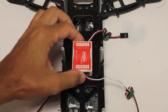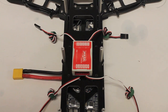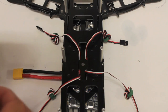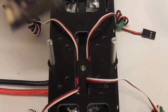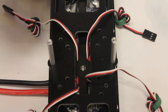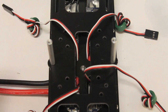In this video I'm not going to be mounting the flight controller. I'll do a follow-up video showing the QAV400 with the Naza, then a test with my APM 2.5, and another test with the MultiWii board. These what appear to be random hole placements actually line up with both the APM and the MultiWii, so you have different hole patterns to mount either board. I bet it also works with the CC3D flight controller.